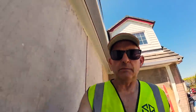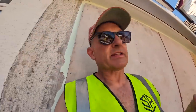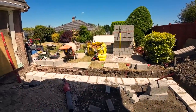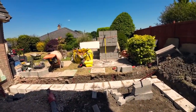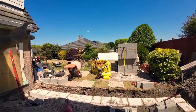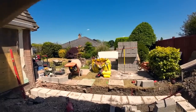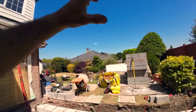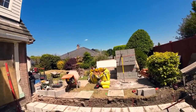It's about 10 past one, had lunch. You've probably seen on the time lapse, which we left over lunch. We've seen Robbie and Robbie here with Danny, who's our structural engineer, going over the door size, because this is going to be a 3.6 door, so it's like what size steel he can get over the top with and keep the room above it. Obviously, the higher the steel, the less room you've got to get your roof over it.